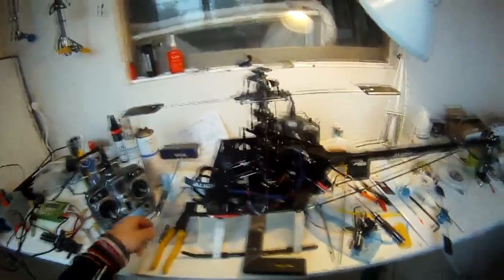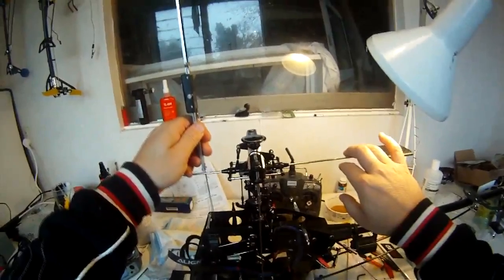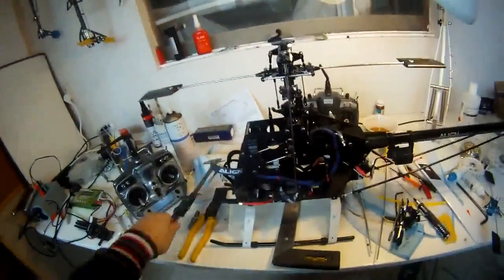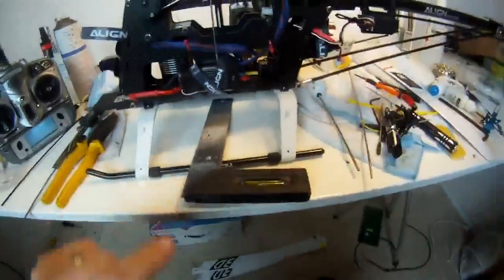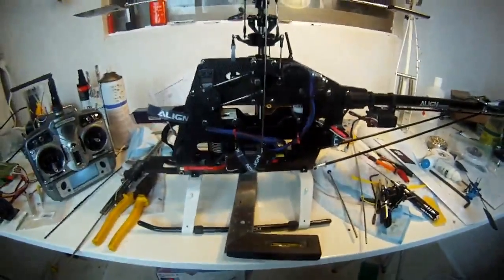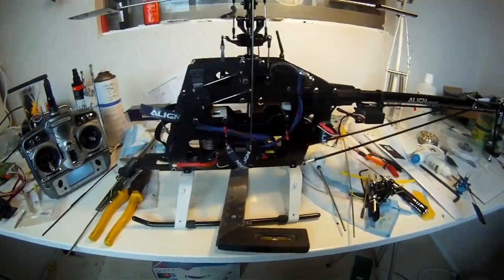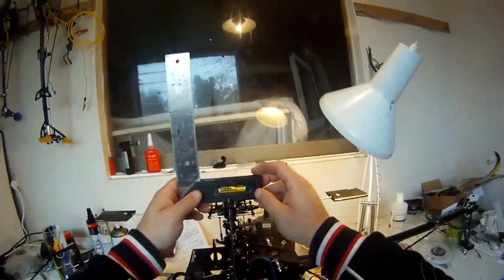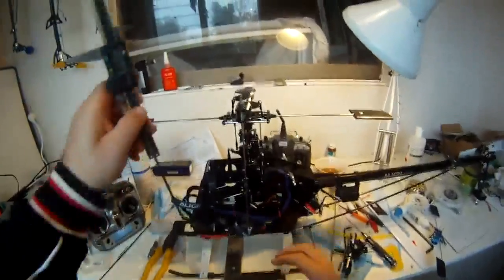What we're going to do now is set the level — we've got a reference point. I'll set my height and lock it, pull it back to there, set it up, and that's level. Carefully move that away and have a look in here at where it sits on the setup. You can put a level on here but it moves around too much and isn't quite as accurate as what I'm doing here, because you can actually see the difference.